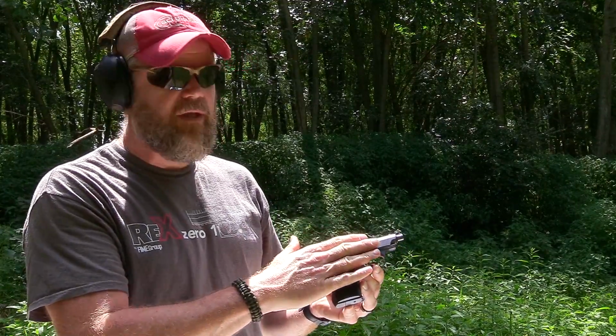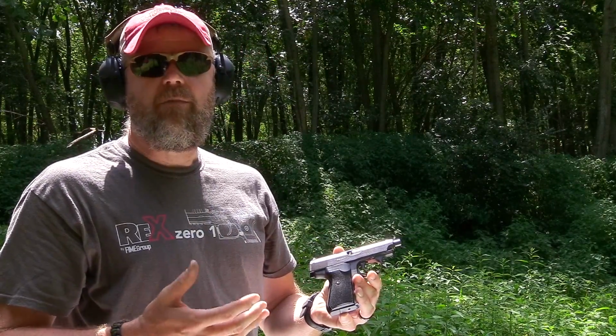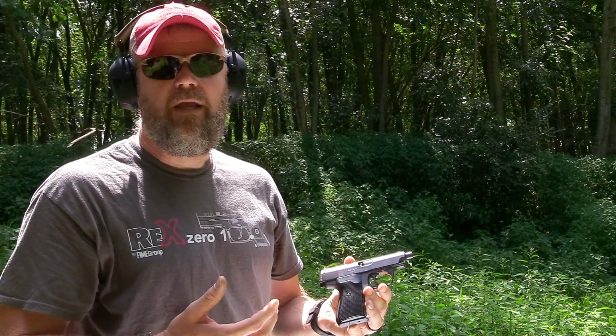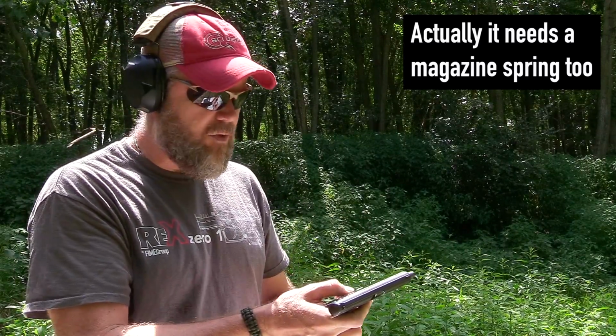You will notice when I took the gun apart that the recoil spring was kind of bent and not straight. That will cause the gun to malfunction. My PP, for example, simply wouldn't function with its original recoil spring in it because it was of such poor quality and had degraded so much over the years. This pistol's malfunction is likely the result of a similar problem, the spring being bad.